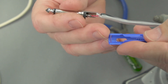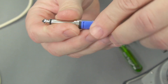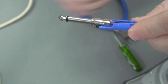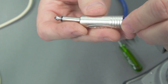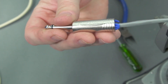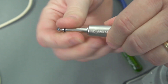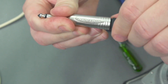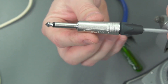This particular strain relief has a little slot, so I can put this on at basically any point. It's going to fit like that against the other part — kind of like a clam shell arrangement. I can go ahead and get the body of the connector, put it on from the front, and it's going to slide all the way down. You can see the jacket is indeed underneath the strain relief. I can bring the boot up and finish the assembly. We have adequate heat shrink coming out the back to help this transition point. And there's our quarter inch tip sleeve.